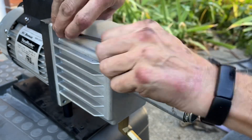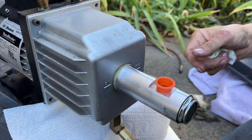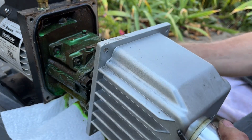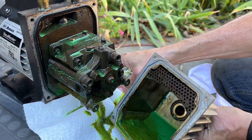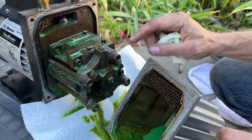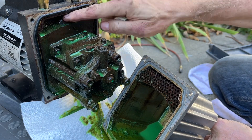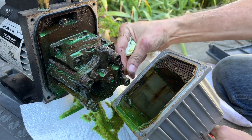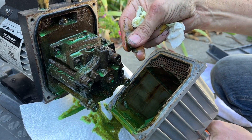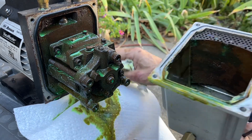I hope there's an O-ring in here so I don't need to buy a new gasket. There's a big towel under here — there we go, last bolt coming out. It looks like there's a nice O-ring in there. Oh boy, that looks pretty sludgy — look at the inside of this. Holy cow. Look at this bunch of sludge all over it. It's a little bit rusty in here too — I don't know if it's been sucking water, but there's a lot of grit in here; it feels like sand or something. This is definitely in need of some clean-out work.